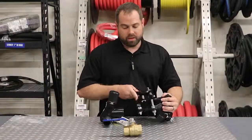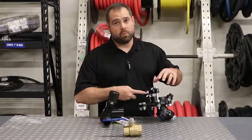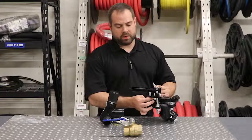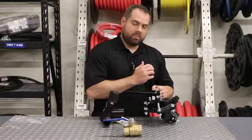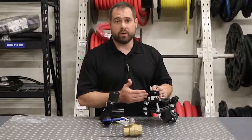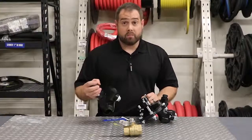It also has the advantage of very quick metering. Once you start turning it out and allow more abrasive through, you'll see a response very quickly — it only takes a little bit. Once you find things dialed in, you can set your stop plug so you can only go so far. If it gets jammed the other way, it closes things off. So you can kind of set it to where you want, but it's not the most precise thing in the world. If you're going for precision, you want a micro valve.